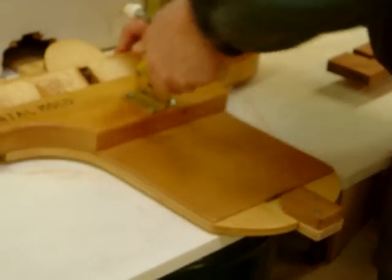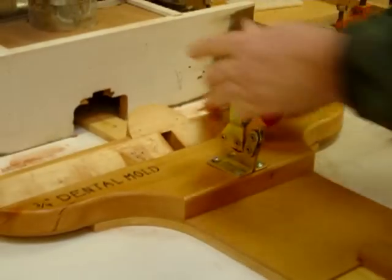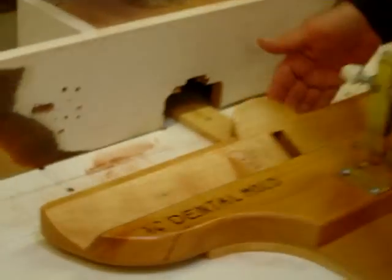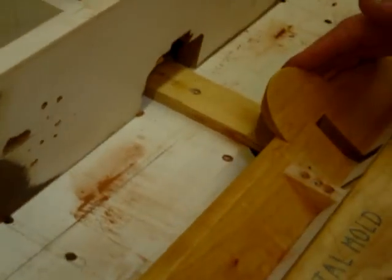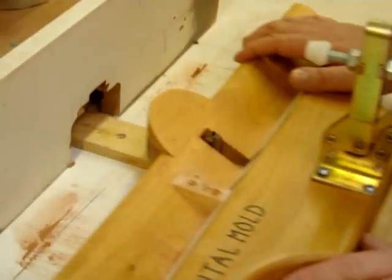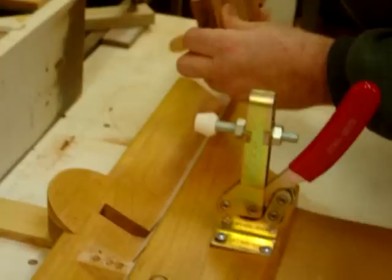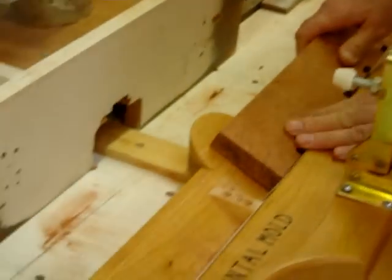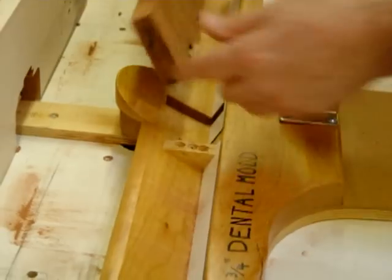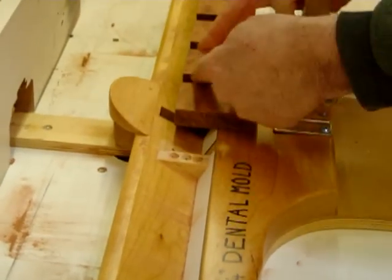A couple of things that are very nice about this setup: with the work piece in place, you can see that the bit does not come out through the back, so it's very safe this way, and it doesn't plunge out through the front, so it's very safe that way. When the work piece comes in, you start the work by placing it against the index pin here, and I'm able to move that to change the sizes of the dimples I want.